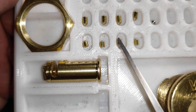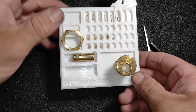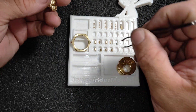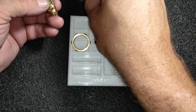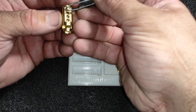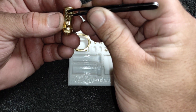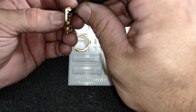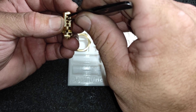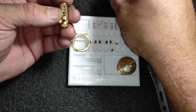But once you put your key in and turn it, you can actually pull the key out because there's enough play. I might put that back together quickly and show you what I mean - put these back in the same way they came out. They had the chamfered section facing towards the shear line, which I've only seen done on maybe one pin in a challenge lock once.